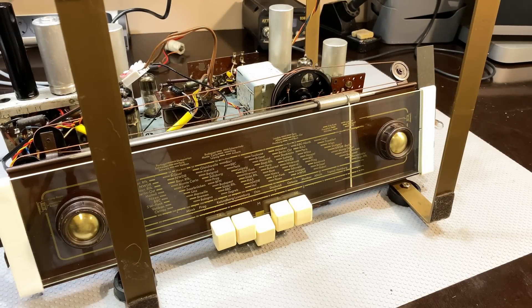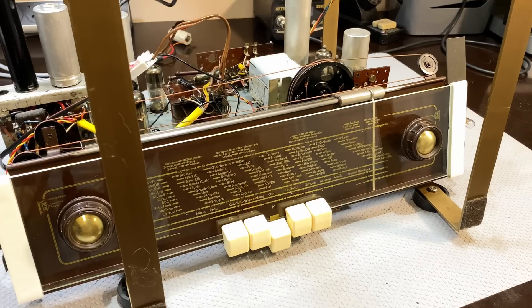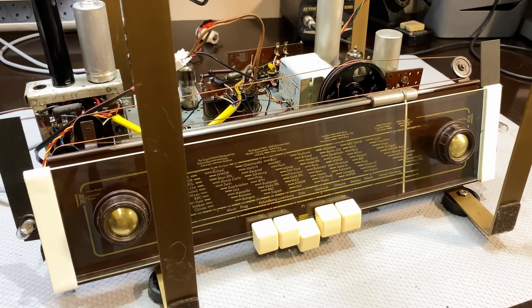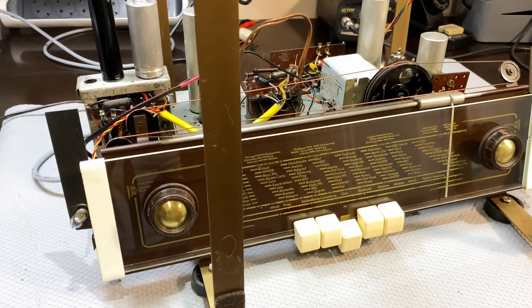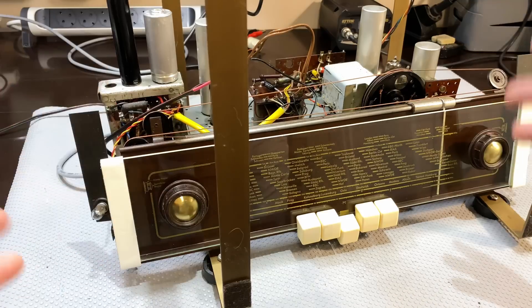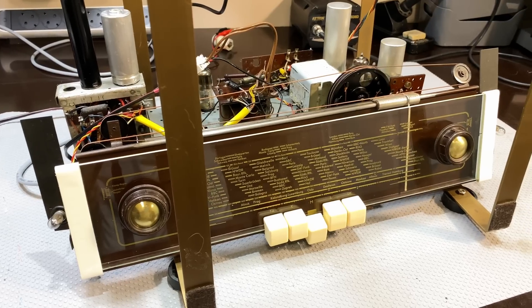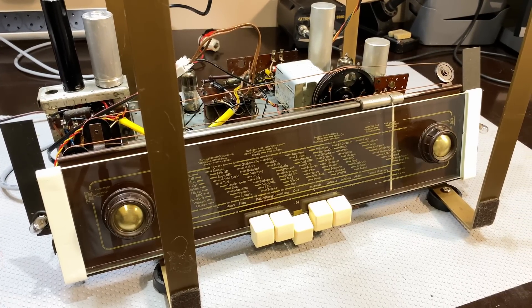I may have mentioned once or twice that I don't particularly like dealing with dial strings. The other thing is I don't like intermittent faults. Intermittent faults are a real bummer because you just can't get to the solution if you don't find the problem. We had the problem of the current just spiking all of a sudden — it was working perfectly and suddenly those dim bulbs went totally bright, meaning some sort of intermittent short. Since I got back, I've been leaving this on for a long time to see if it would come back, and it just hasn't. So I decided to get going on the other stuff.